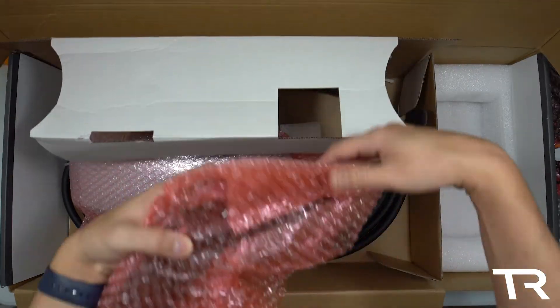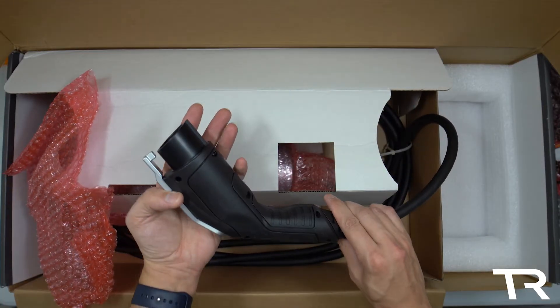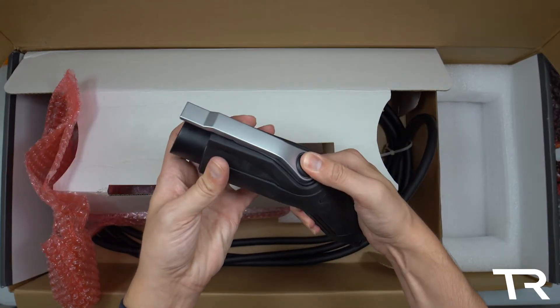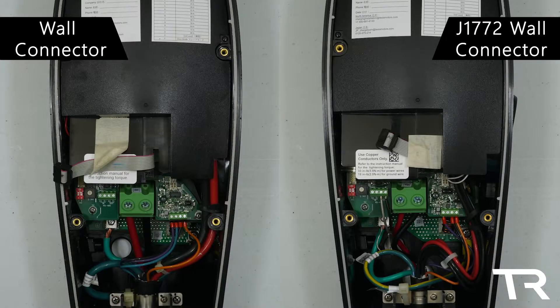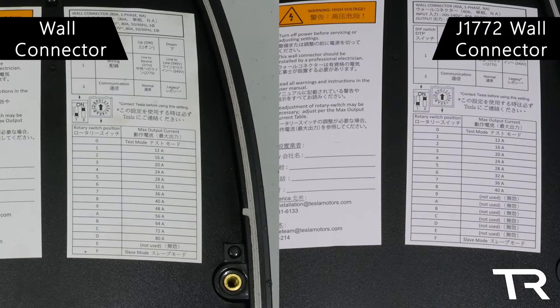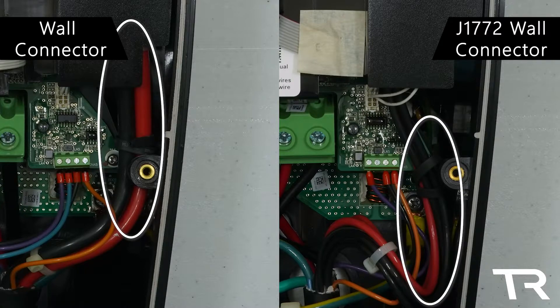The connector is really solid and well built. It has a good heft to it, and the release bar on top actually appears to be aluminum. The electronics on the inside look mostly similar to the standard wall connector with a few exceptions. The label at the top is different — the standard wall connector includes rotary switch settings from 12 amps to 80 amps, where the J1772 is limited to 40 amps. The wiring to the connector is also different for the same reason — the wires are considerably thinner as they only need to carry half of the maximum current of the standard wall connector.